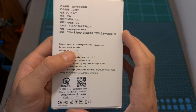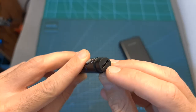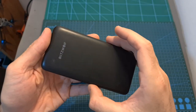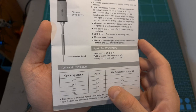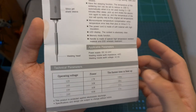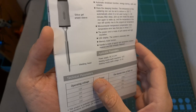In terms of specs, the supported DC input voltage is between 12 to 24 volts, so even though it features a USB Type-C connector, you can't power the soldering iron using a power bank, even if it supports quick charging. The maximum power of 60 watts can be achieved when supplying the soldering iron with 24 volts, and it's going to take between 13 seconds to 100 seconds for the soldering iron to heat up to 280 degrees Celsius depending on the operating voltage.